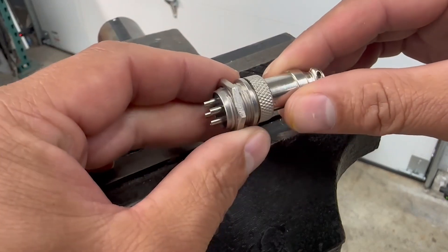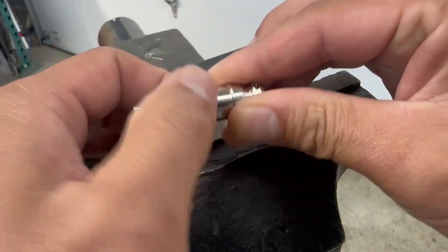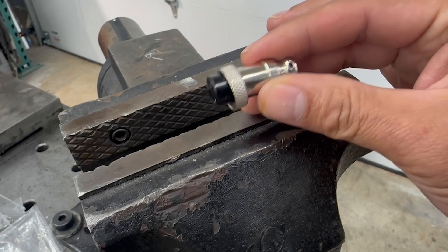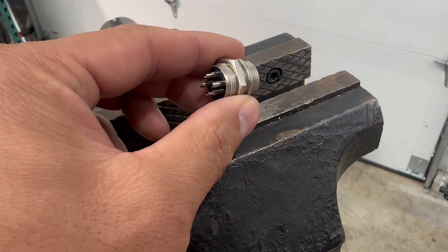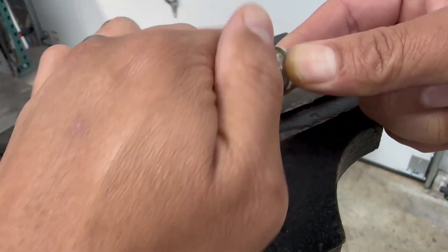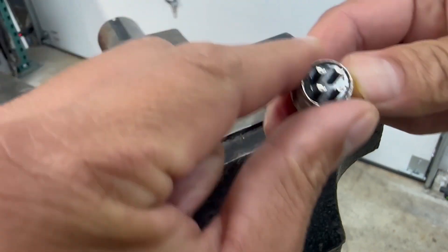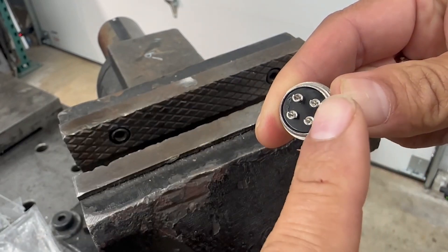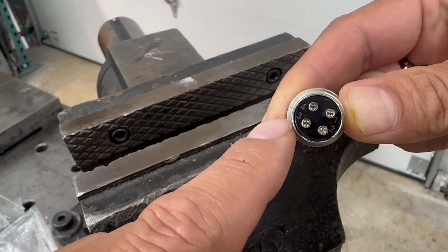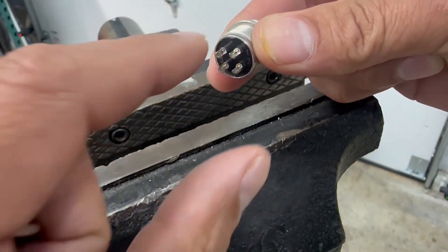I'll break down this aviation plug real quick. This is the plug that's going to replace the one that's in the press brake right now. This side here is where you connect the cable side — the long 15-foot black cable. And then this side here is the side that replaces the connector currently in the enclosure of the press brake. You'll see it's labeled one, two, and three. I believe you'll use one and two for your black and red — that's for the kick pedal that does the bending. And three and four are going to be used for the jog buttons. You'll solder the wires to come out as well.